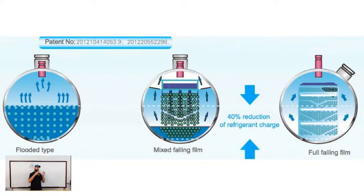It still has a rail, but the rate at which we're putting the refrigerant in, we do end up with standing liquid in the bottom. And that's where, like a York is, this is the most common design they use on their YK series. They have used the flooded type, but almost everything that they're producing now is coming out with a hybrid evaporator, because you get tremendous efficiency out of it, because you do still have a layer of liquid refrigerant standing that is processing that refrigerant down, but you also are able to dramatically reduce the amount of refrigerant required.